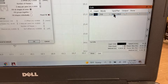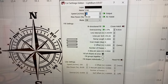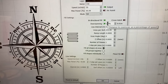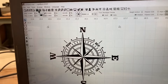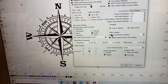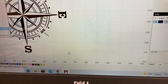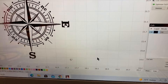The next thing I want to do is change the speed. I want to reduce this down to 20 inches per minute. That's going to make it take a little bit longer to cause the burn. And I'm turning off the air assist. This is based on some experiments I did with another piece where I spray painted it and did not get the results I wanted. So today I'm slowing it down and turning off the air assist. For those asking about millimeters, to convert from 20 inches per minute — that's 508 millimeters per minute. I'll go ahead and switch this back to inches, click OK, and time to grab the glasses.